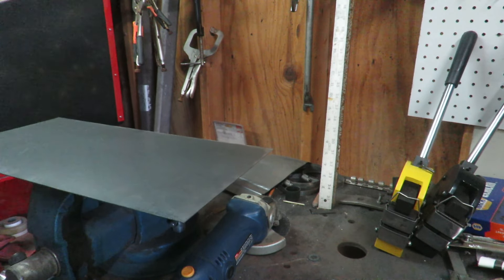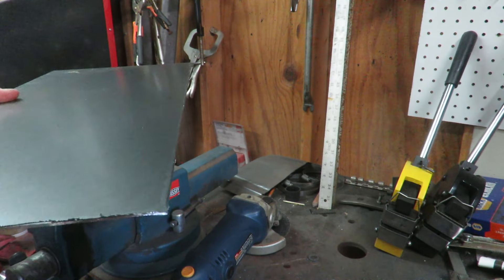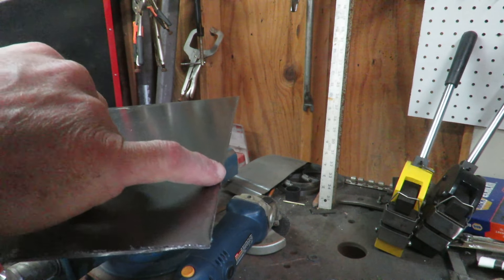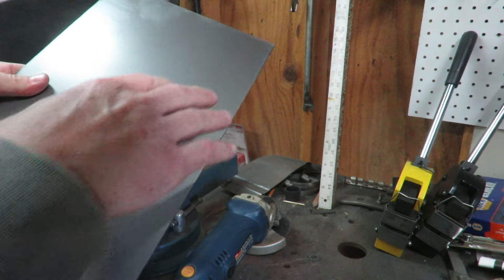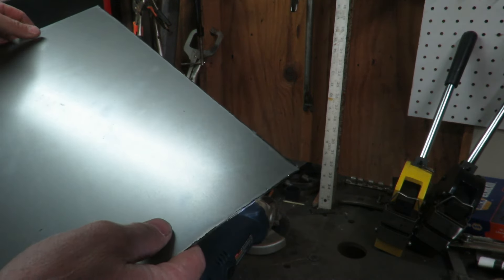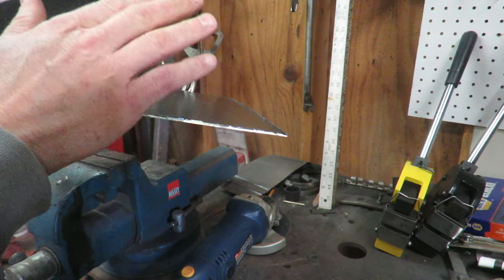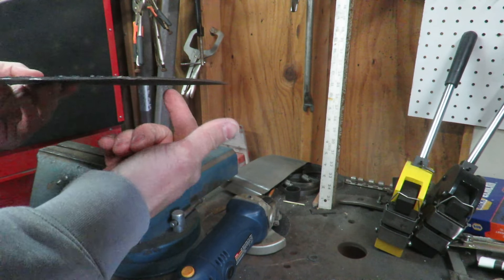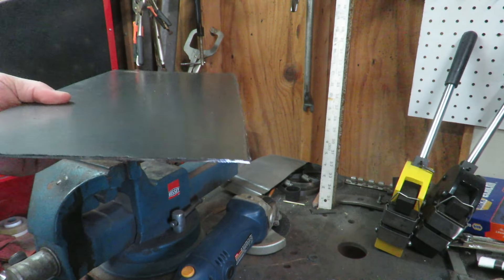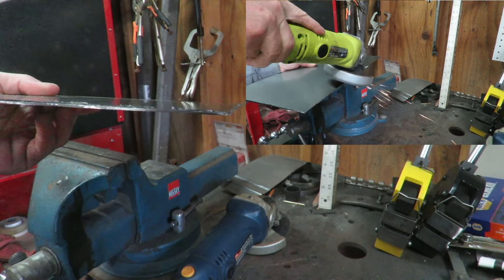I scored it with an awl. Now what I'm going to do is — because when you cut it out with an angle grinder it leaves like a lip on it from pushing some of the metal over — I'm going to go ahead and take a flap disc and clean that up. Then we'll start looking at putting it in the English wheel and getting it curved this way, and then start folding over the edges and then putting the offset in on the top for when we want to do that overlap.